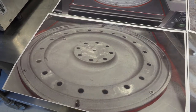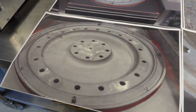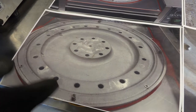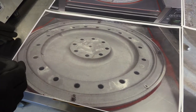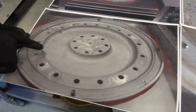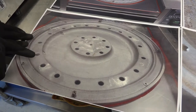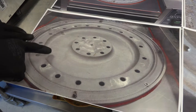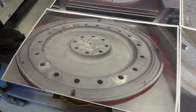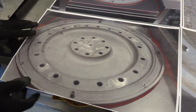In this video we will demonstrate the proper maintenance of the generator heating element. We have several pictures detailed here that exhibit good maintenance, poor maintenance, and very poor maintenance. The first picture shows a generator that is bare aluminum. While none of the orifices are clogged or obstructed, we do need the presence of a light calcium coating on the racetrack area for proper steaming characteristics. In this case, this generator would require seasoning.